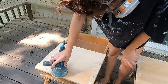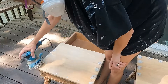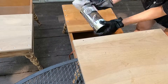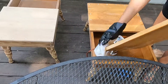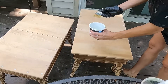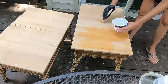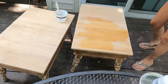Just keep that in mind if you're filling holes for something like new drawer pulls and you're going to leave that hole exposed — it is going to stand out like a sore thumb if you plan on staining it. When you are done sanding you need to make sure you clean everything really well. In this video I'm using Amy Howard brand Clean Slate product, which is okay — I don't love it and I probably won't buy it again, but I have it and I'm going to use it. Soap and water is just as fine as any other product. You basically just want to make sure you get everything clean so you can ensure proper adhesion of your paint and you don't get any debris stuck in your paint.